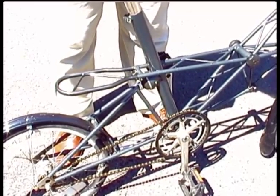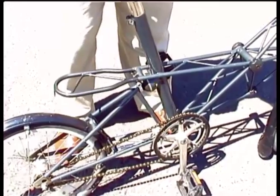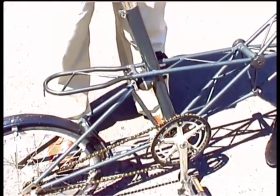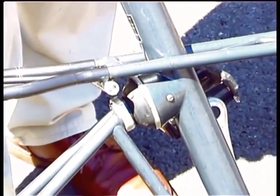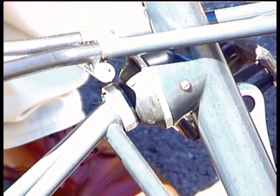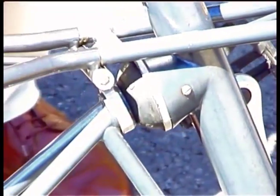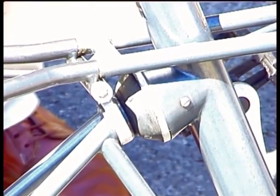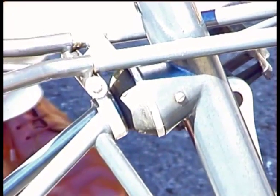Looking at the rear suspension now, Keith is just going to put a little bit of flex on that, and you can see that it's a rear triangle rather in the style of the Mark III, but again it's refined. So if we go into the unit there, rather than a simple rubber ball, we have a monosphere. There's a curved surface on it, so the area in contact with the cam plate increases, so that changes the rate of the suspension a little bit as you go down. But also inside there, the rubber cone, well, it is a conical section on a metal cone, so therefore the rubber is in shear as well. So it's another example of shear and compression, but in a very small and light unit.